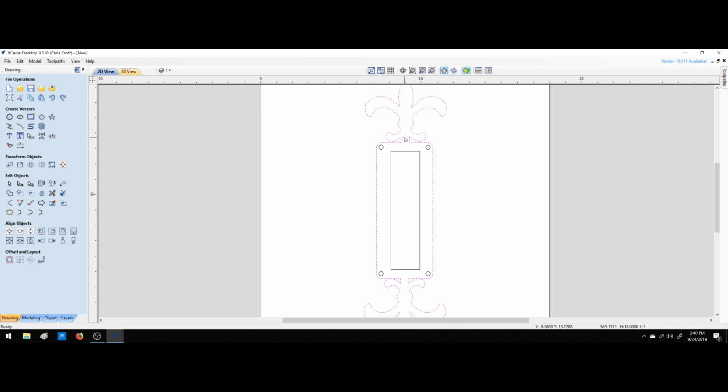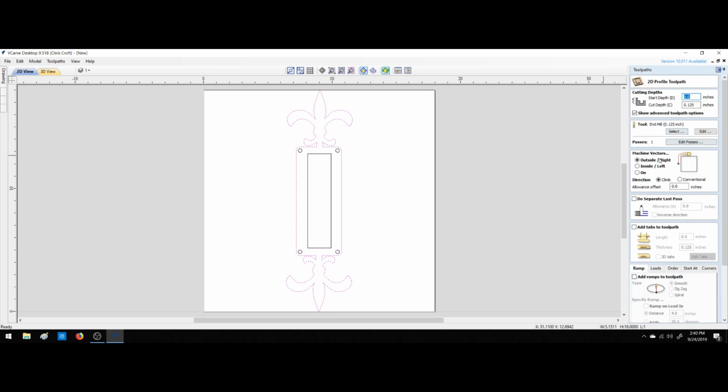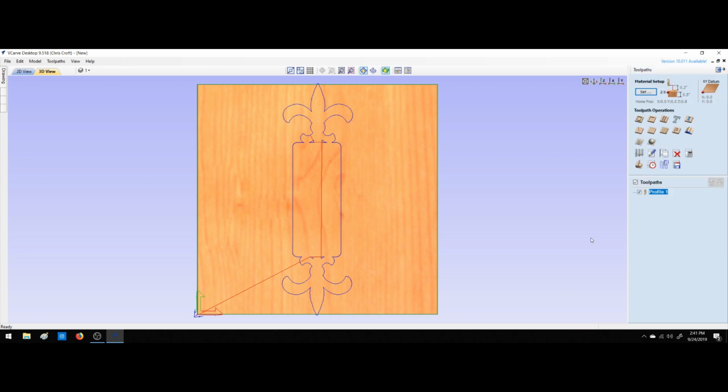So we're going to have to do some work here, because it's going to completely dismiss this in the tool pathing. If we use a profile cut, 1/8 inch tooling, 1/8 inch deep on the outside, let's do conventional, no tabs. Yeah, see, it lost that and that. Okay. Alright, if they're losing that, then I'm alright with it. These are bigger, but I doubt anyone would notice, and I'm not really doing this. I'm just showing you guys how I do it.